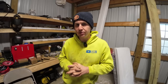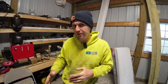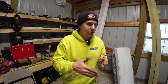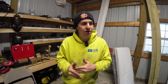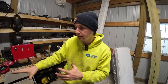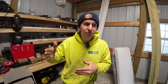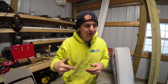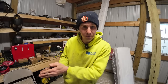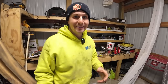The question is, do those outlets shut off before it idles up and surges power or after? Because if it automatically shuts that outlet off before the voltage increases, then that should be okay, no different than plugging it or unplugging it. But if it surges in voltage before that outlet kicks off, then I think that's gonna mess with the batteries. I think I might hook a voltmeter up to it and just see what happens. That way I know. Yeah, that's what I'm gonna do.